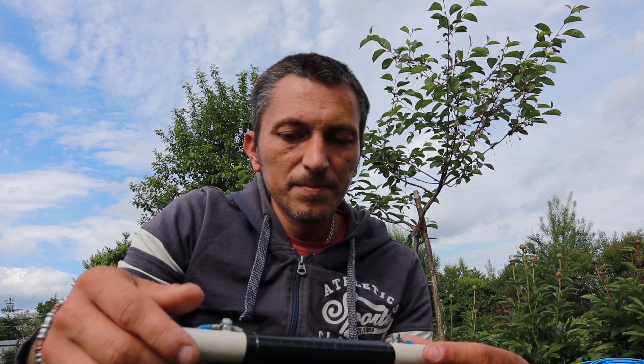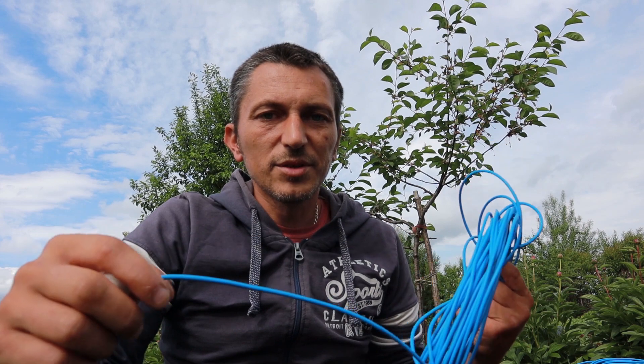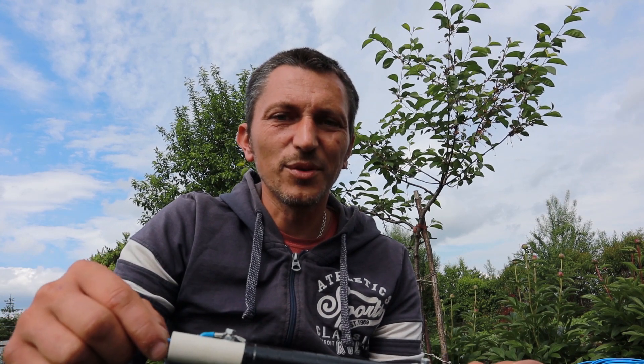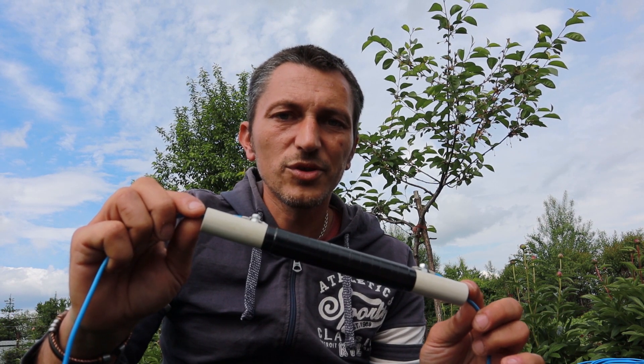I think it's a great antenna for portable use as well. You can build it even lighter and smaller — you don't need wire as thick as mine. I built it like this because we've been having strong winds and heavy snow in winter that makes the antenna heavy. I'm going to use my current wire for the house antenna and build a lighter one for portable use.